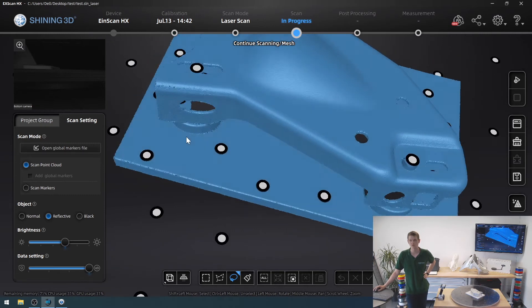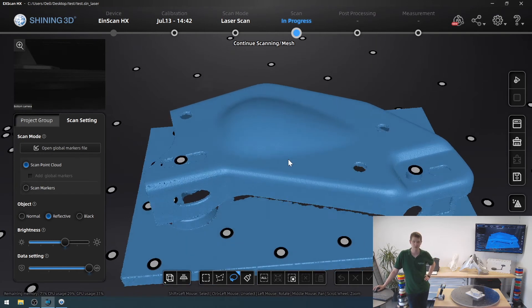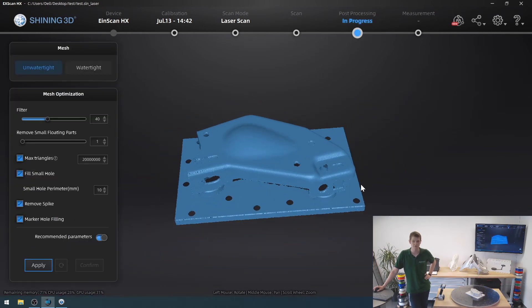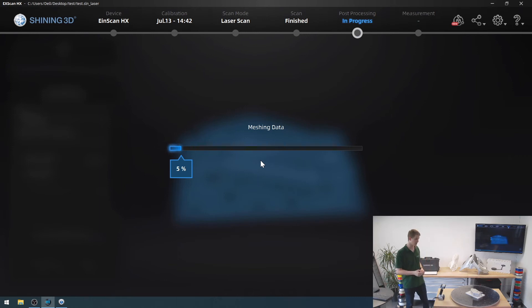This will now allow me to use a third-party software such as VeriSurf or any other inspection software to compare the distance between any two holes, the shape of this bulge, anything like that. Of course I am limited by the accuracy of this scanner. The Einscan HX is not designed to be a metrology device. If you are looking for something like that I recommend the FreeScan UE7 or UE11 for even larger models. But if your tolerances aren't incredibly tight, this might be perfectly acceptable and a very good alternative to the more expensive FreeScan line. The Einscan HX is just a very impressive scanner that time after time yields impressive results.